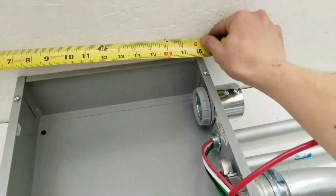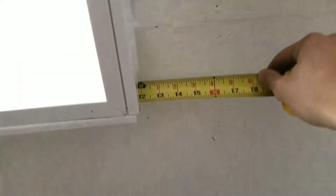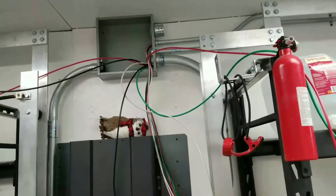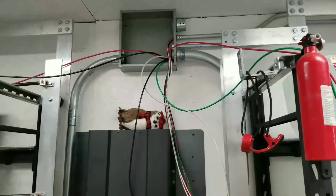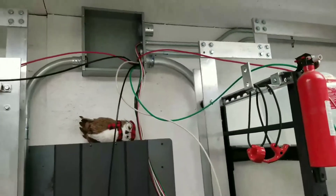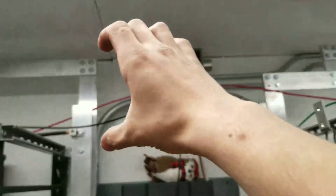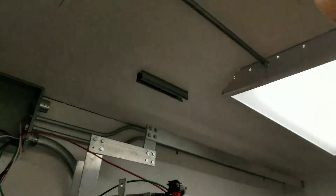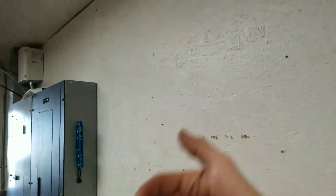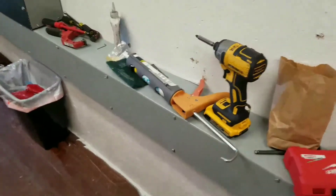We are 18.5 inches from this seam, so that would be 12.5 inches — we clear up here of the light fixture, because at 6 inches we would just hit the edge of that can. But I think that would look a little tacky. So I think what I'm going to end up doing is getting gutter 90s — that way you don't need to worry about the cover plate. I'll just have gutter, gutter 90, and come across. Cover plate would be on this side facing this way, and then we'd come down with the cover plate facing out and hit this down here.